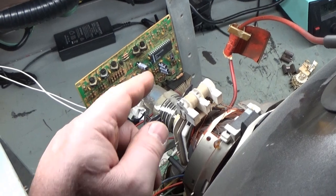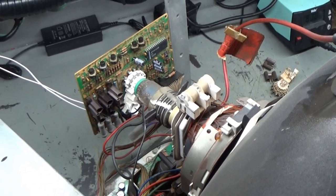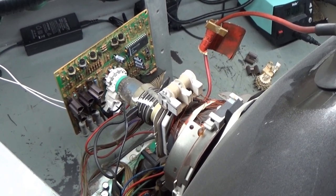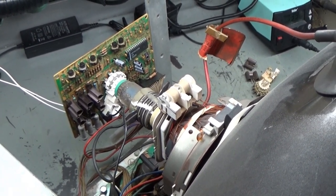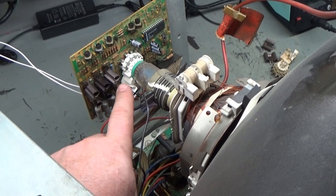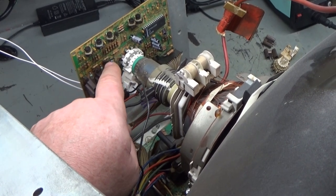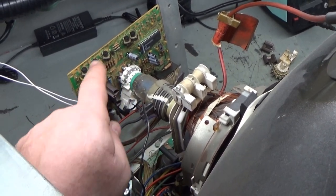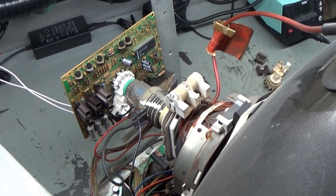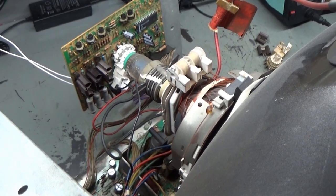All right, so I successfully swapped out that transistor I had mentioned, and it made no difference. So basically back to square one. At that point, I went through and tested every component over again, every trace, every pad, and did everything humanly possible, and I eventually found the problem. I had mentioned before that this resistor for the red was ice cold. The transistor was ice cold, and the resistor was ice cold. And we know it wasn't the transistor. We know it wasn't this little transistor. We know it wasn't the little transistor over here. We know it wasn't the pots. We know it wasn't the encoder chip, and I was about at a loss at that point, and had already checked the resistors for the correct resistance. They all read 2.7K. Everything was fine.